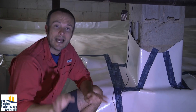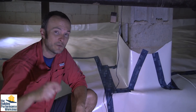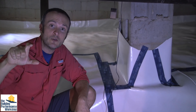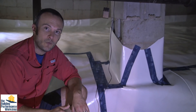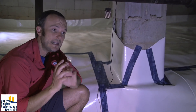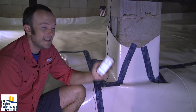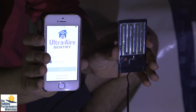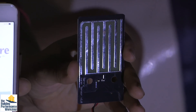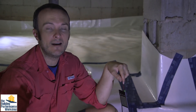It seems to be working very well so far. The last piece of the puzzle is that, no matter how good a job we do air sealing and sealing the dirt away, we have these cinder block walls with four inches exposed at the top — to allow for termite inspection, because termites are big around here and this is an old house. So we have a moisture pathway. We need a dehumidifier down here, even if just for peace of mind. We're going to use an installed permanent dehumidifier rigged up with our HVAC system. Until then, we're using the UltraAir Sentry humidity monitor — a beautiful little humidity sensor that tells us the dew point and temperature down here so we can track it from upstairs via an online portal, without having to come to the crawlspace. And we'll be able to diagnose how big of a dehumidifier we need.